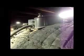And coming down here, this little collar thing is kind of obscuring them, but these three things sticking up here are the pop-off valves, or safety valves, and each one's set to a different percentage of pressure. 245, about 275, I think, and then 312, which is the absolute limit of the boiler. Anywhere above that, and we'd have trouble, because the pressure will push out, and it might cause an explosion. So before that can ever happen, we want these things to start going off.